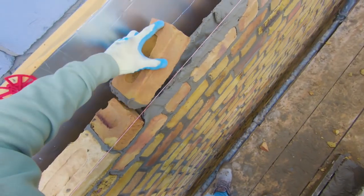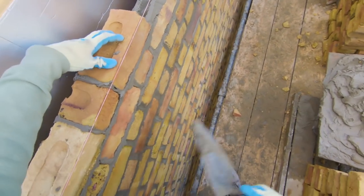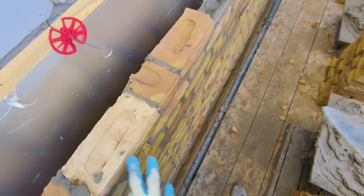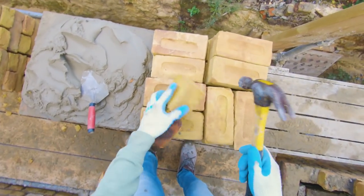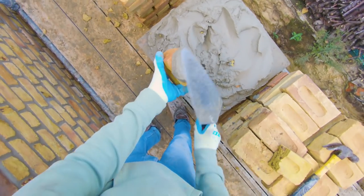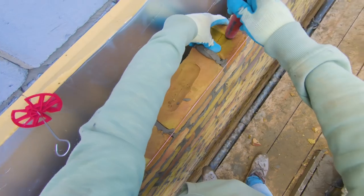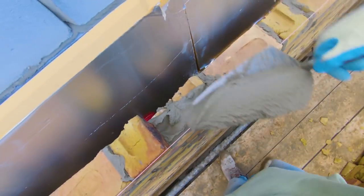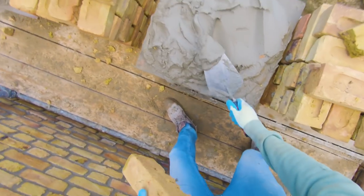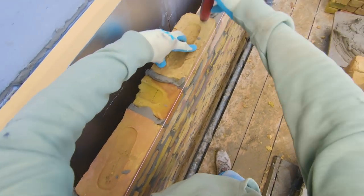Butter up nicely, sling her in — there you go. That perp's in line now. These bricks are so varied in size — some are almost 20mm bigger than others — so I'm not paying a large amount of attention to the perps because these bricks are just so varied. But that's the aesthetic of it. When you chip bricks, be careful you don't get a bit of stone under a brick because you've got to lift it up, and if it's in the perfect position you really don't want to be lifting a brick once it's been put down.